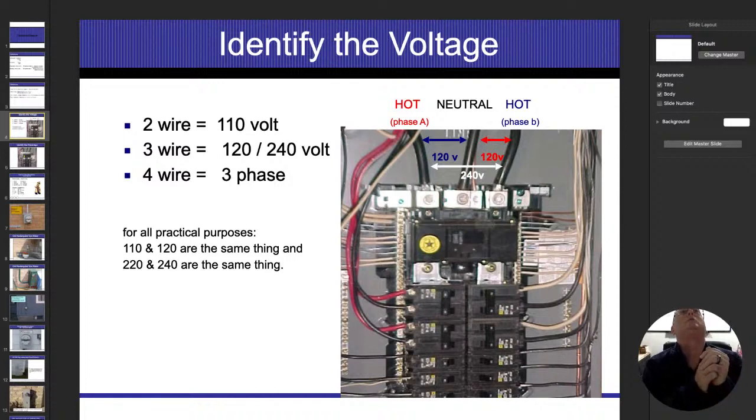It's hard for me to see on this one. I'm just going to guess it's 100 amps, and it doesn't matter what it is. We're just going to make an assumption. So if it's a 100 amp circuit that comes up there, that means I'm going to allow up to 100 amps to flow on my energized conductor, and I'm going to allow 100 amps to flow on the other energized conductor. And if you remember, I said amps don't disappear. So off the cuff, I could start thinking, well, shouldn't I be sending 200 amps if they're fully loaded up there? That's not true. All right. They don't disappear, but they do cancel each other out. And that's why we can get by with two energized conductors and only one neutral. We don't have to have two neutrals coming back out of it.